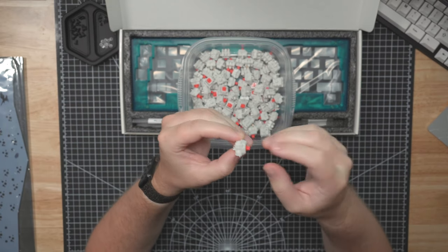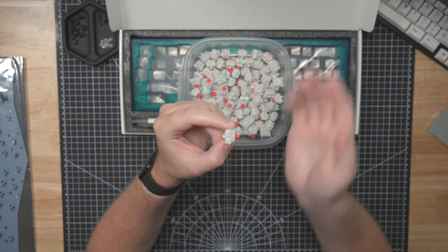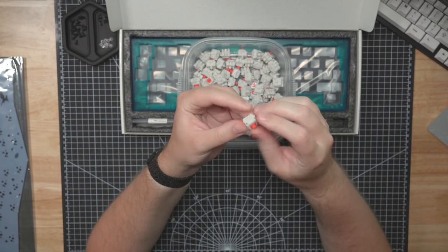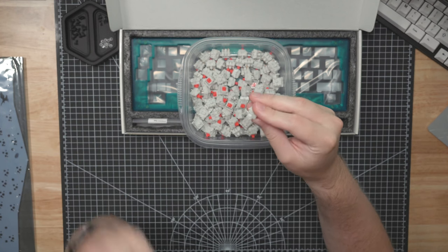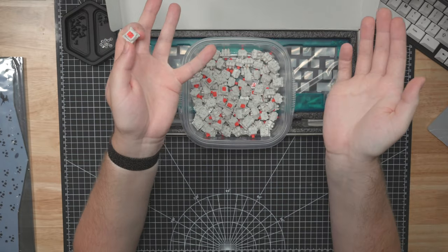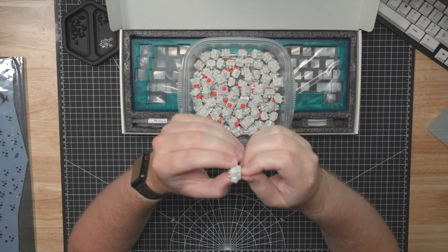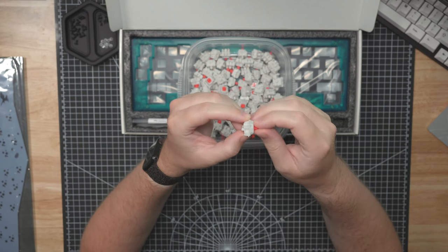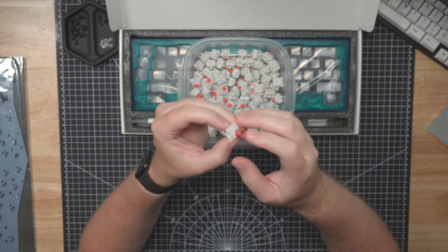So giving them a shot. And I was like, oh, well, we need springs. So I found a US vendor who had mauves. It was Canon Keys. And I was like, oh, I really like long springs as well. I like the way the high preload of a long spring feels in a linear switch. So I looked at their long springs, and well, they had long springs in 69 grams. So how was I not going to? Can you blame me? So it is a long stem, which Matt hates, in a housing that we can't agree with the pronunciation on, with a 69 gram long spring. So these switches are really everything Matt hates in kind of a beautiful way, and kind of everything I love in kind of a beautiful way.